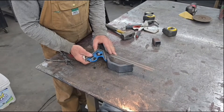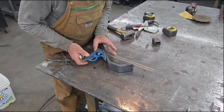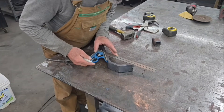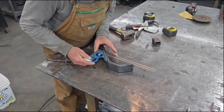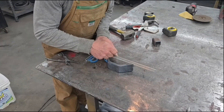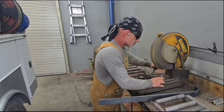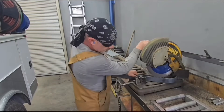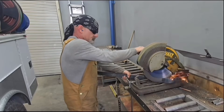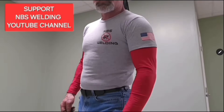The next thing is to figure out where to cut this off. I'm going to set up on this 45 with the combination square. I'm going to split the difference between 45 degrees and my six-and-three-quarter outside diameter — you see me counting on the ruler. I want to make sure I have six and three-quarters of an inch outside diameter even if it's not exactly 45 degrees, and then we can saw that off.